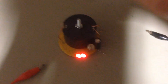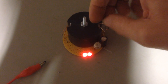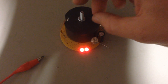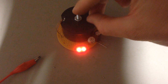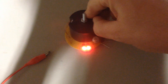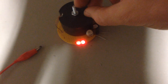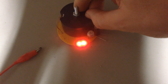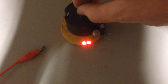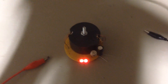Microwave test, scope test. I know for a fact that I used up some energy a few times touching between this coil. If I touch — let me pull this up and show you something. I can run the system down faster just touching between here and the ferrite or here and the screw. You can see I can bounce and kind of tune this and get the brightness up — that's really bright right there. But for longer run time, it's better to connect this to a ground. When I do this I actually discharge the capacitor some as well. There might be a point to try to connect and capture some energy in a looping arrangement between these two points.